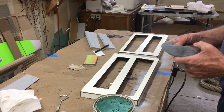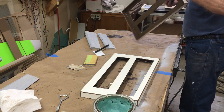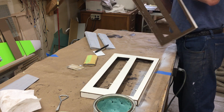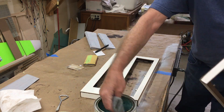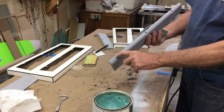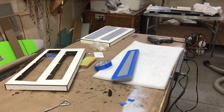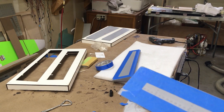The parting planes are all cleaned up, sanded down, everything fitted. I'm just going to put a heavy coat of wax on them — this will help with release later on. I'll also double-wax the control surfaces themselves, the plugs, and this should assure me a nice release. I've already pre-waxed them before this video was made but they need a couple more coats. Like before with all the other parts, I'm taping up the plug so I can apply hot glue to it and help it stick into the parting planes.